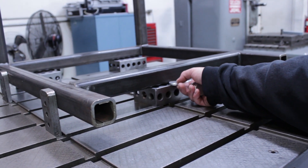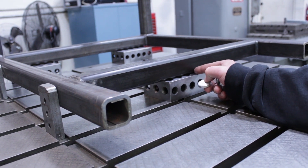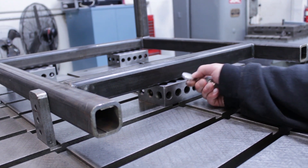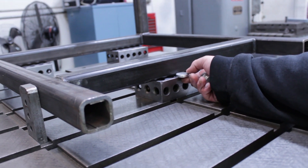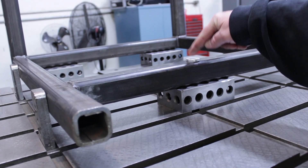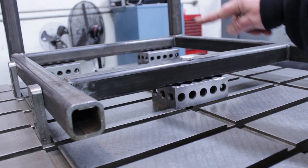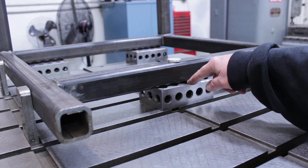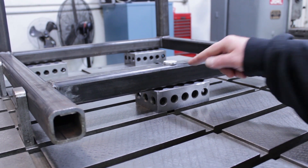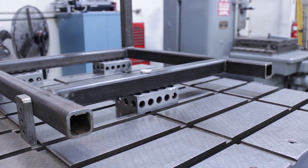The reason you do three instead of four is because you don't want to twist the weldment. A lot of times you can set the part up on blocks if it's relatively flat and a good weldment like this — you don't want it to rock. Or if it's a real irregular weldment, you can set it up on these points or zots. Put another one on top and you basically apply your pressure and direct your pressure to the zot on the bottom, and we do it on each two, four, six block. This will not rock on three points. You don't want to bend the weldment and then have it change its shape once you release your clamps.